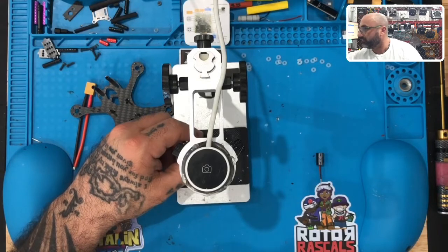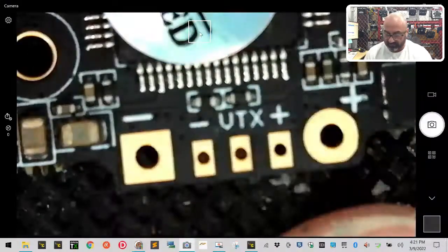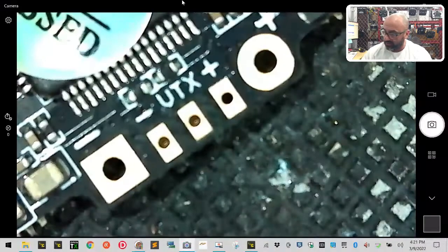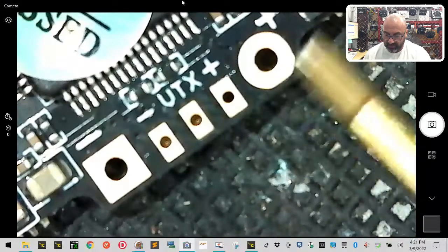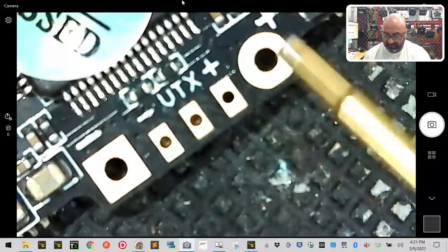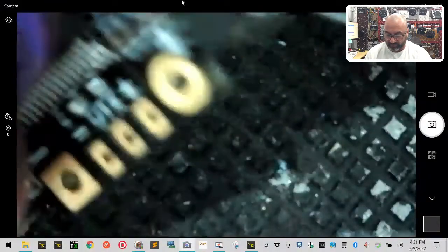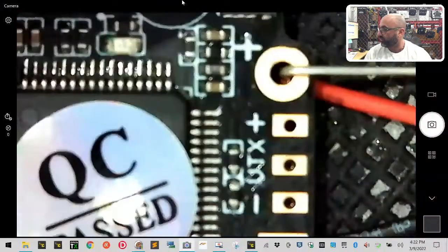Here's what we're looking at on the microscope. Your USB port is here for orientation — we're viewing the back of the board. We have ground, another ground, VTX, a positive and a positive; the two grounds are tied together and the two positives are tied together. We're going to take the capacitor, go through those two holes, and bend it flat so it lays down — then fold the wires over to keep it in place. This is what you want it to look like.